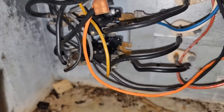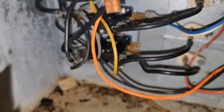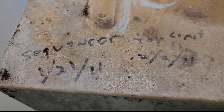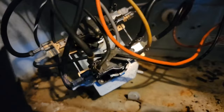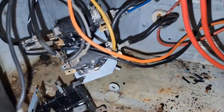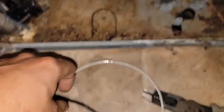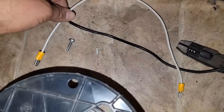Just wire for wire. Looks like someone wrote on the panel - sequencer was changed in 2011. It's 2022. Got a drill with an extension. Take the other one loose, wire for wire. Found a couple burnt wires - one from that terminal to that terminal. Took it out.